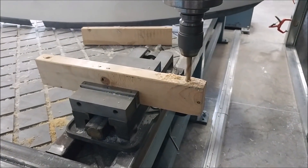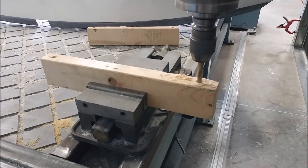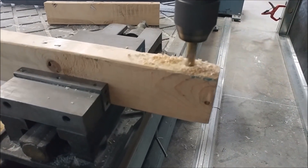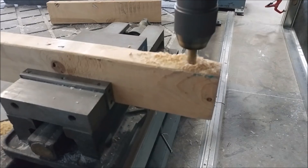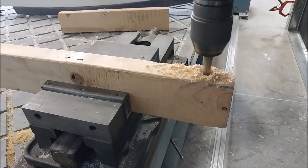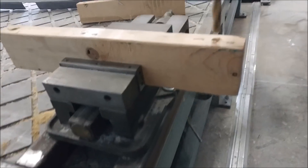The next thing for the gear was to create a little fixture. I decided to use a couple of 2x4s and space the holes per the CAD. One hole is the lower rotational point for the gear leg and the other is the upper mounting point for the retraction bracket, drilled on the machine for accuracy to help align the rods and brackets inside the gear well.